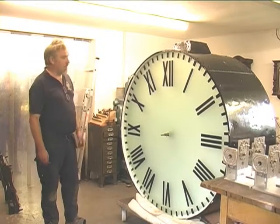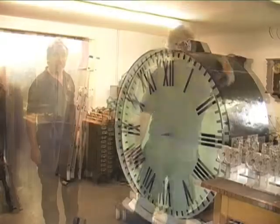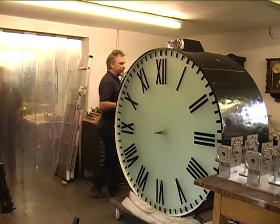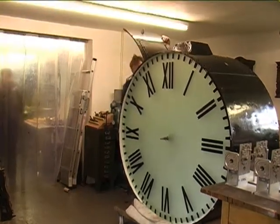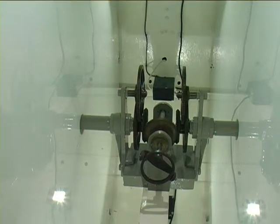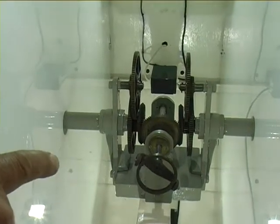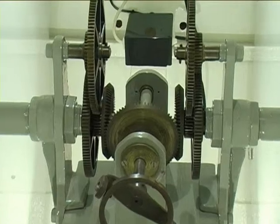This is how the dial would look during the normal daylight. Then you should be able to see inside the drum, and you'll see how the baffles are fitted — it just helps to diffuse the light. What we're looking at here are what we call the dial motion works, and they give the 12-hour reduction between the hour and minute hand.